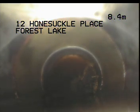But it's something that I would say would definitely need attention in the future. I don't think that this is related to the ensuite toilet at this stage, but it may present symptoms in the future. I'll just jet rod it one more time, see if I can clear that a bit further. But as far as the camera goes, that's it. So basically we have that first junction, which is actually below concrete in the ensuite area, which is at approximately 800 deep. And then we've got this one, which is at 2.12 deep, which is the council connection, which appears to be at the boundary fence line, which I'll jet rod a little bit further now.